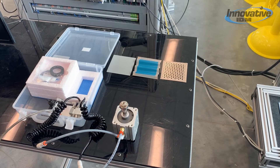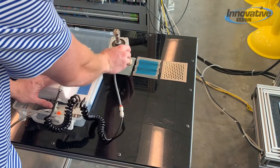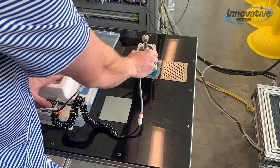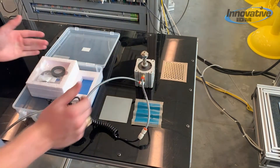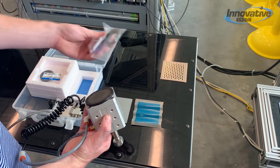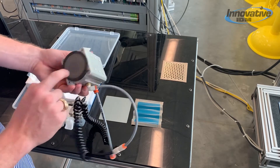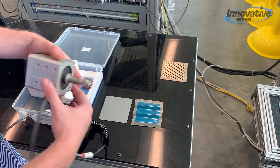Back to this MHM magnetic gripper — we'll see it in action. This would be great for a pick-and-place application requiring a large piece of sheet metal or a really heavy metal part to be moved around. And instead of using rubber seals like on the previous magnetic gripper, this one uses a rod to adjust the magnet's distance from the surface, so you can fine-tune your holding force by simply rotating the knob.